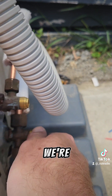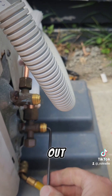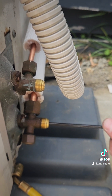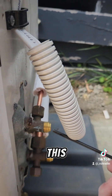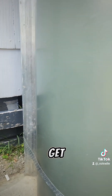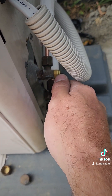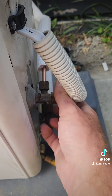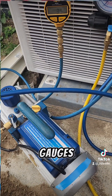So now that we have done that, we're all vacced down — just slowly let these out. Now always go all the way out, back in a little bit. But you see that valve is not very good, so this heat pump is maybe on its last legs. I've just moved it so that they could get this water tank here. That is how you gas up the heat pump, gauges and all.